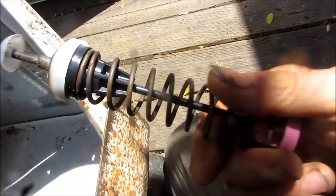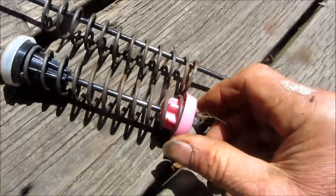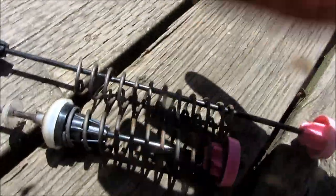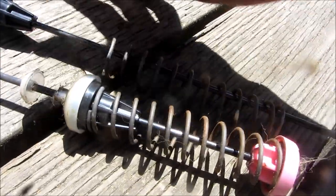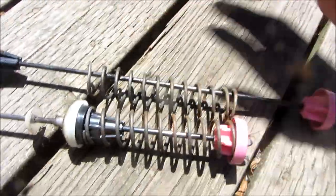These springs basically take all the weight of the load. So if you're doing big loads, these springs are going to go down and just not be the way they should be. You can see this one I stretched out a little bit — it's got a little bit more. All four of them I'm going to stretch out a little bit more, and I'm going to put some silicone or some sort of dampening goop on here to slow the squash down.